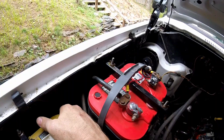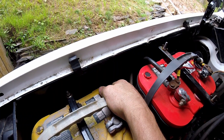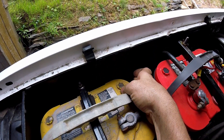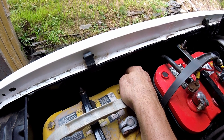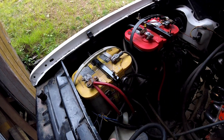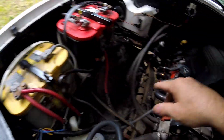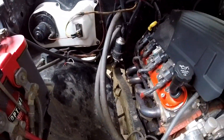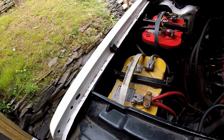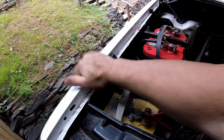What I did was go through and put a nut on the back, because the piece I had welded into the fender just pulled through. I'd take that square threaded tab off, put the bolt back through with a big washer on the backside to hold it with a nut, and tighten them up so my batteries are secure. I'm gonna try to leave these bolted in and not mess with them, because it's a lot of work to undo all that. If I can get it to drop down enough to get in there with the welder, I'll go at it.